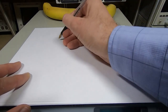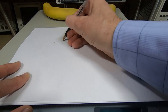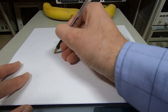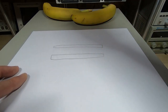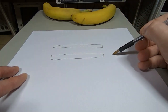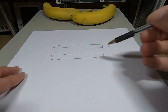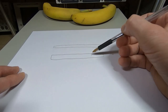So firstly, the baffles. So inside the machine, if we look, imagine we've got an X-ray and we look inside the machine, it looks like this. There are a series of 4 heaters. Let's draw 2 of them, and they're shining infrared energy down onto the board. And the problem with this is it means you get a hot spot underneath the 2 heaters, and that causes local hot spots on the boards as well.